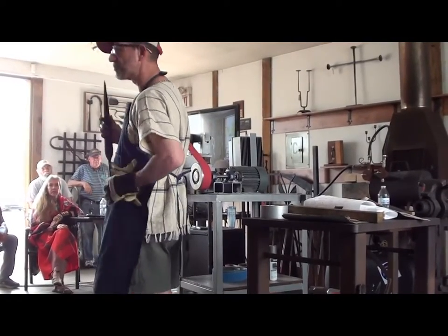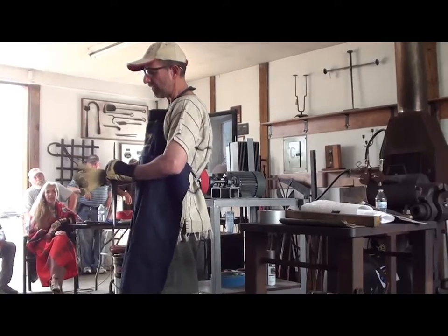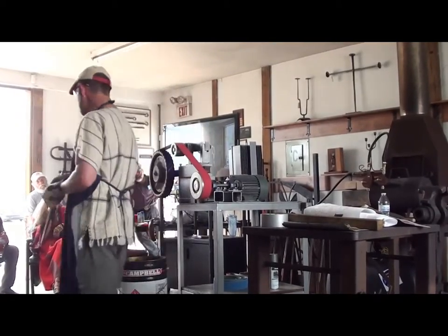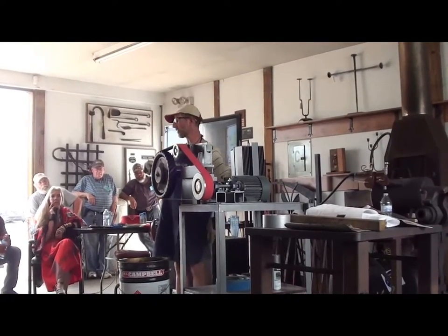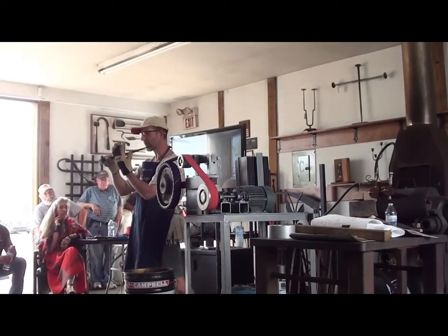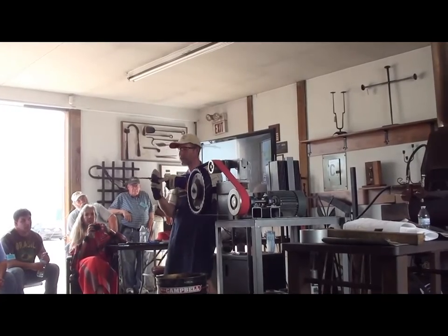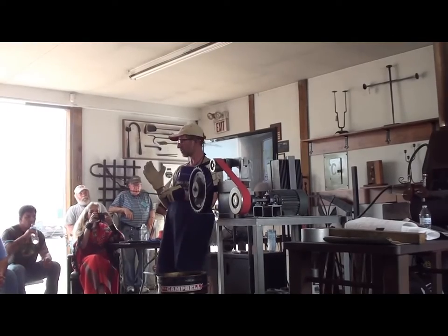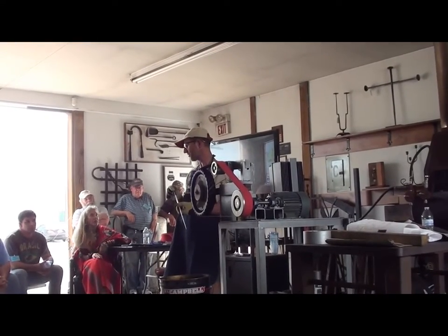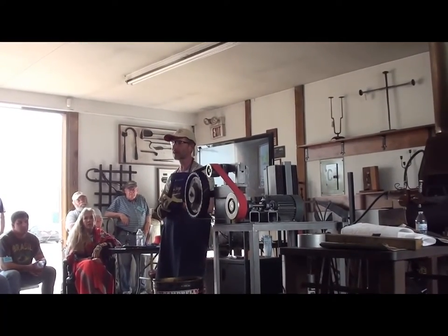Something I happened to do just by the nature of me profiling this blade - in order to prevent stress cracks from the quench propagating from the cutting edge, it's wise that just before your heat treat you run your blade in the long direction along the flat platen. Usually when you've been profiling, you've been grinding on a flat support and you've got the scratches running across the edge. That's going to cause a stress crack, because you've got scratches across the short direction of the edge, and if the stress and scratch conditions are just perfect, they're going to propagate up through the blade. But by grinding those scratches in the long direction, that crack hasn't got a pathway to follow. It can make the difference between that blade cracking or not cracking.